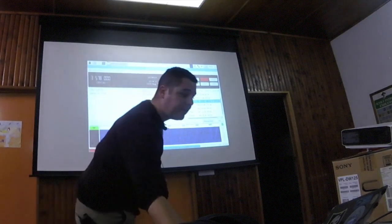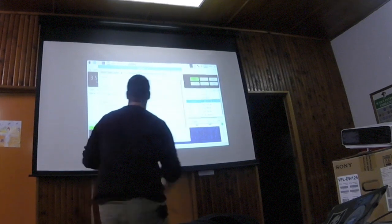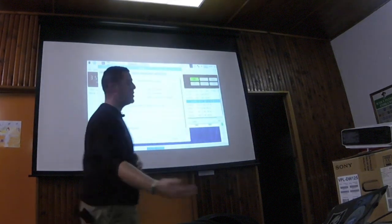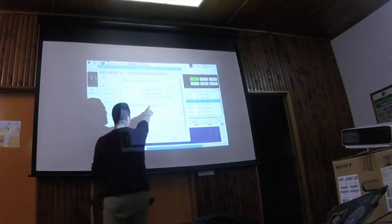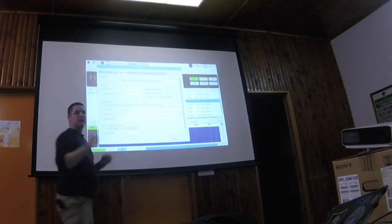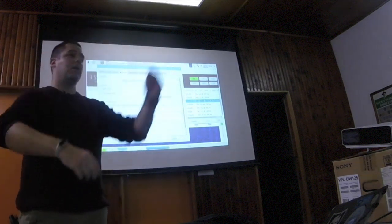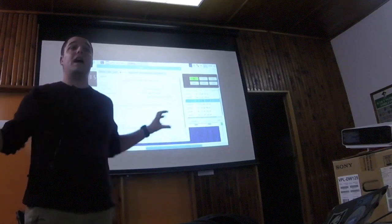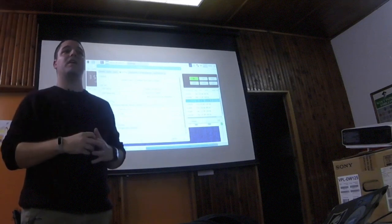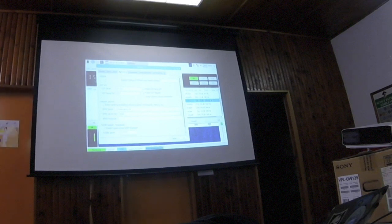Every bit of software, every receiving station, if it's connected to the internet. I'm not actually on the internet, so I never tick it. Tick box: enable spotting to reporting networks such as PSK Reporter, APRS-IS, etc. If you tick that box, whether you're at your station or not, you hear it, Pete hears it, and whoever gets the internet first puts my station up. So every station that receives on any HF, VHF, UHF, or up into SHF, it does all the reformatting and everything to get it into APRS. Leave all that messy decoding stuff to the software. You don't actually have to see it.